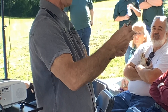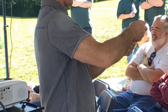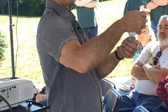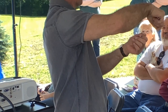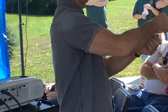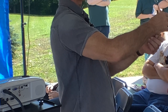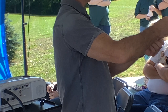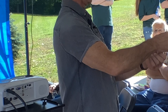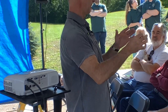If I were creative enough, I could sign my name with that in my thumbnail. I don't know why I would. But that little drag test is a great way to tell if that's sharp or not. Take the table saw blade out of your table and do the same thing to one tooth. Just get one corner and drag it like that, and you'll feel the difference: there's some resistance. When it's dull, it's rounded over, and it just slides across your nail with no resistance at all. If you do it with something sharp and something dull, you'll see it right away.